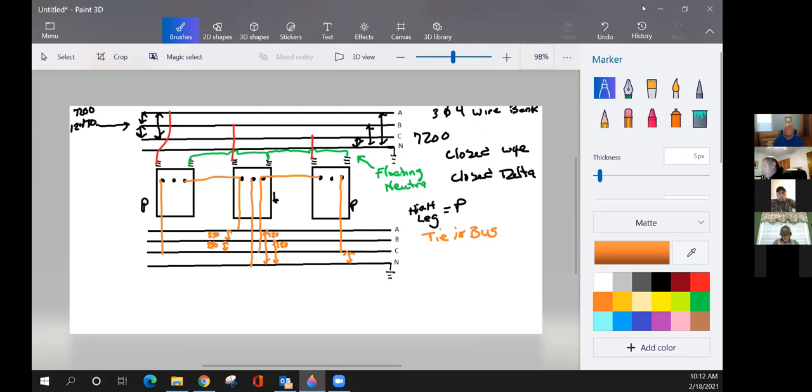Okay. Now look at your right-hand transformer. What's the voltage coming out of that one by itself? 240. Look at the right-hand transformer. I've got that would be 120 coming out. What's my voltage? 120. There you go. You got 120 on the left, 120 on the right. All right. So keep that in your data banks right there.